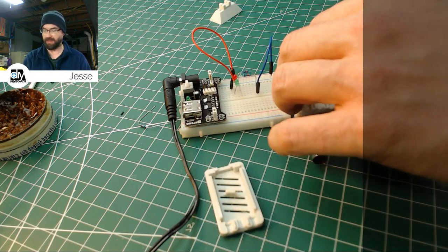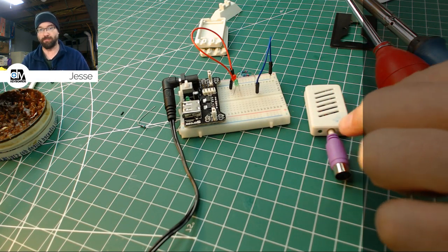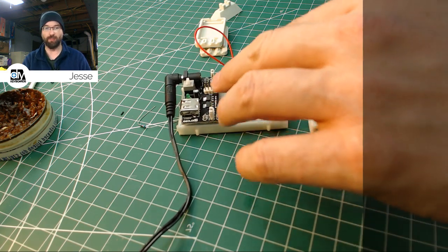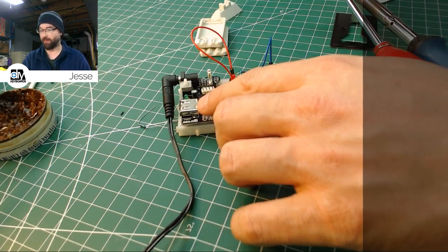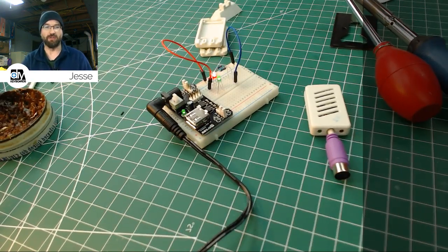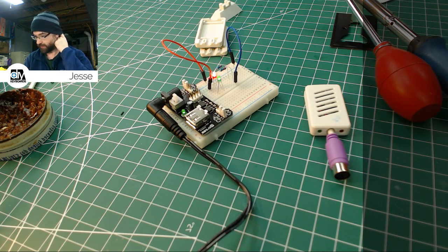The other issue we had was that the two LEDs that indicate on the front here, num lock and caps lock, the one was brighter than the other, and that kind of bugged me. So we're going to start here by fixing that, and what I've got is a breadboard with a little power supply on it, and if we switch this on, you'll see I've got the red and green LEDs on here, and the red is substantially brighter than the green, just like it was last night. They both have 220 ohm resistors on them right now, which is what I had started with. And theoretically the red and green LEDs take the same resistor value, but the brightness just isn't matched very well. So I just wanted to demonstrate the difference.